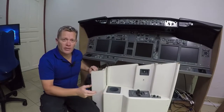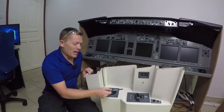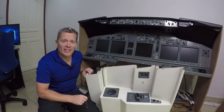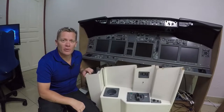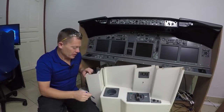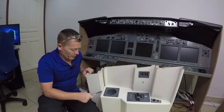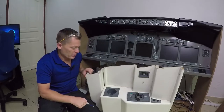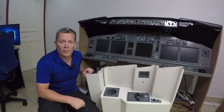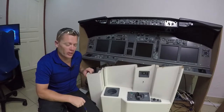Based on the same premise, we'll have the cup holder. I was going to hopefully reuse these panels here, but they're just the wrong size. Obviously everything being 20 centimetres smaller in the overall diameter, all these panels are just a slightly fraction smaller. This panel here should have been 150 by 155 millimetres and I think this one is 140 by 140 — just a little bit too small to go into the new sidewall assembly.